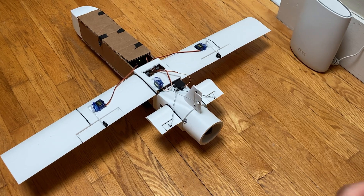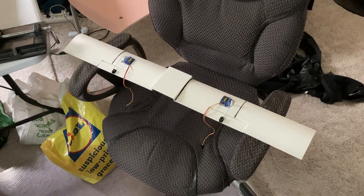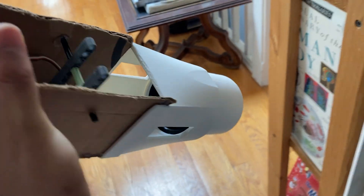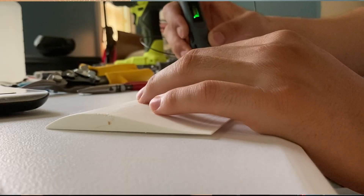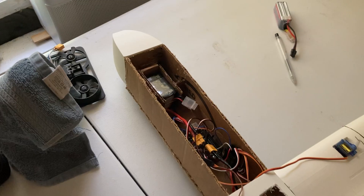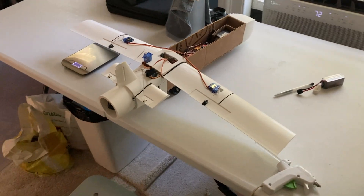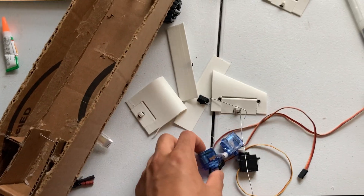After the last video, I set out to design a lighter glider-style drone. I used cardboard as a main fuselage component and designed massive wings that sat on top of the fuselage. I added a complete set of elevators, a rudder, and ailerons, and housed the EDF in the back by designing a coupler that fused the rectangular fuselage and circular fan. In total, this weighed in around a kilogram — cutting 200 grams from the previous design. There were still a lot of problems: the cardboard didn't bond well with the PLA, neither mechanically with screws, nor through welding with the 3D pen, nor through adhesives like super glue. As a result, the whole thing was flimsy and fragile, still too heavy, and because of the heavy EDF and two-stage coupler, the center of gravity was way back — which forced the wing all the way back to maintain static pitch stability. I did like the high wing design and the control surfaces, and carried those into my next design.